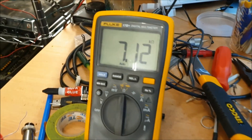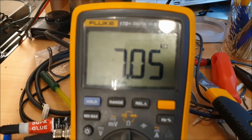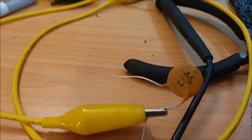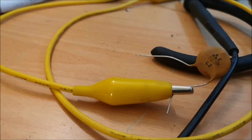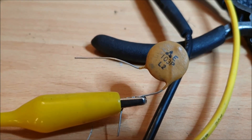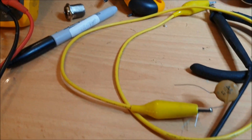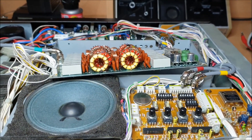I'm going to pull that out and have a look. There's a suspicion that these transistors have either gone low gain, or this capacitor is giving me trouble. I've pulled out that little capacitor. I'm more interested in whether it's showing some resistance versus measuring its capacitance value, because it feels like it's causing that oscillator to generate — this capacitor would have had to go into high-end resistance. And what I expected is what I got: 7.1K. So I'll grab a replacement 0.01 out of stock and put one of these in to see what results we get.